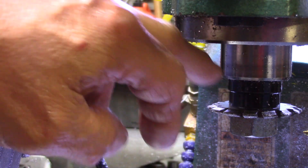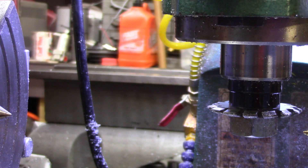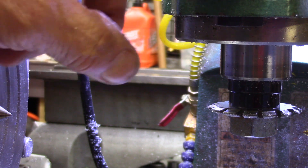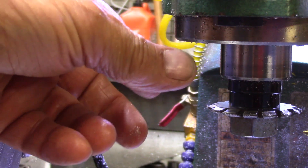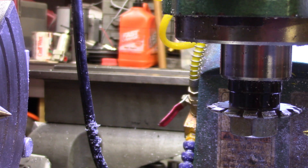In the future I'll have to make another arbor that hangs down a couple of inches lower so I can get all this hardware back up out of my way — then I can cut even bigger gears, up to at least an 8-inch gear. But that took a couple of hours off my time moving things around. Also, this cutter is 20 thousandths thinner than the thinnest other cutter I've used so far, so when I tightened my nut up it was still loose. I had to go back and machine that nut to have a little hollow inside so it would go up over the shaft and clamp down on the cutter.